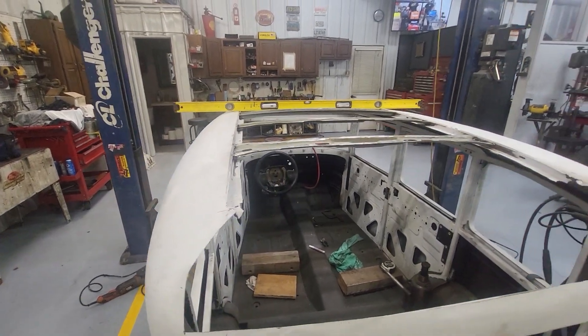What I did was step it in and put it in the bead roller. So there's the weld seam, but this piece is continuous — you can see some wheel marks in it but I stepped it over and then down. This is the same piece of metal going up and around, bead rolled in. Now you can see the continuous weld where I screwed it down — I filled those holes, plug welded the holes. It worked out really good and I tacked it on several spots.